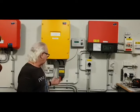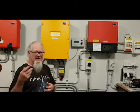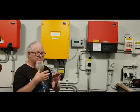During the day we've got maximum solar input and maximum battery charge, so excess draw is more likely to happen in winter when days are shorter and nights are longer. In winter you're using more electrical lights and things, so you're using more power anyway. The system sorts all that out. We've got a 14 kVA diesel generator which is very economical — in winter it might run for about an hour per day, or sometimes not at all depending on the weather. Solar panels are actually more efficient when it's sunny and cold; when they heat up they lose a little efficiency.